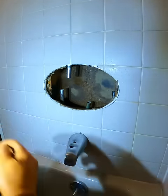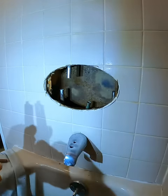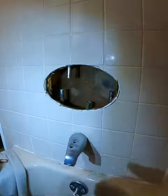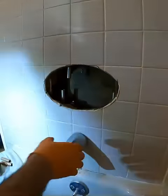Right now I'm pre-cutting the pieces out of the shower valve. It's the same size every single time. It is 2 1/4 from the Moen shower valve with integral stops, gives me the full 8-inch rough. The next step I just did, I've learned that if the copper from face of copper to the finished wall is more than 2 1/4, the valve is too far in the wall.